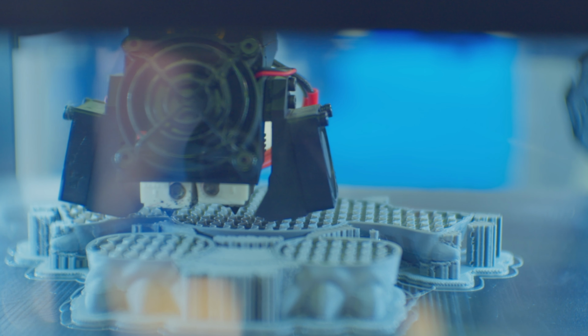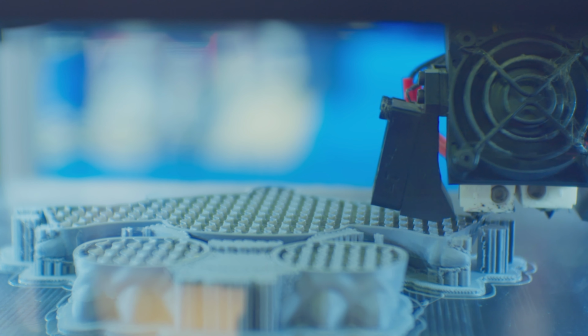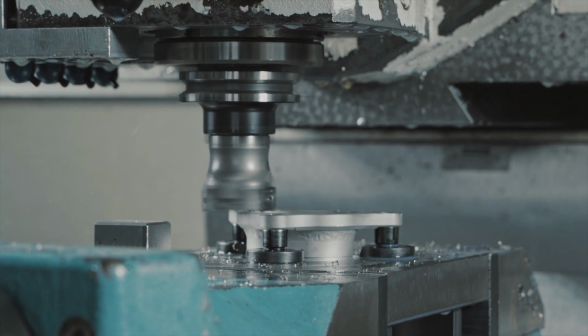Now after printing these bolts, there's something that I noticed that's actually not good at all. The threads are way too tiny, and it's not going to be effective for the project that I'm working on. The problem is that the resolution of this technology of FDM 3D printing is just nowhere near what you can get from machining a metal bolt. And when you want a really strong bolt in 3D printing, you want to increase the heftiness of that thread. So instead of having an isometric thread, we're going to be bumping that up to an Acme thread, which is a really meaty, solid thread that you find on really huge machines like manual mills.